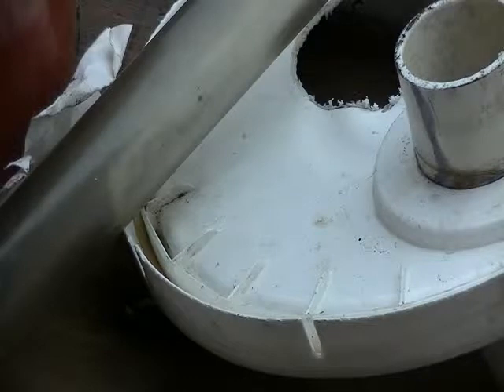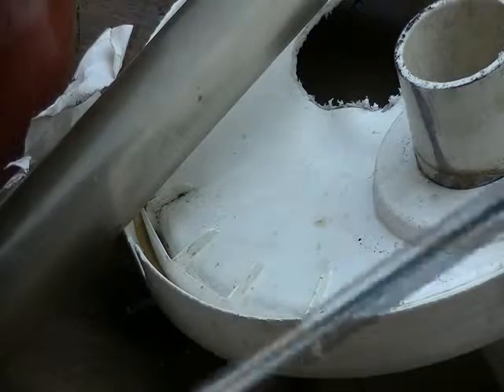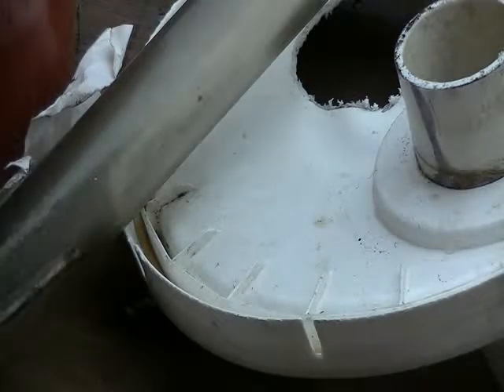What I've tried to do is add one more filter along the way before it gets to that carburetor. This pipe here gets hooked into the last of the four filters — the tri-filters like Flash has — and then this goes directly to the wood gas carburetor and air mixing valve, and then to the engine. So I'm going to add one more filter.